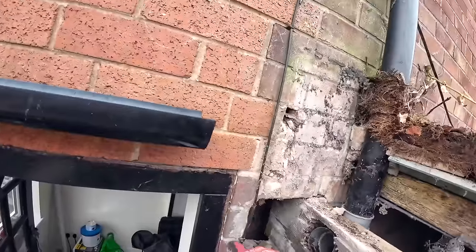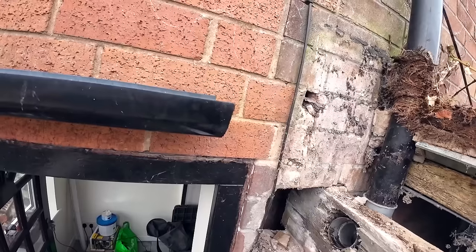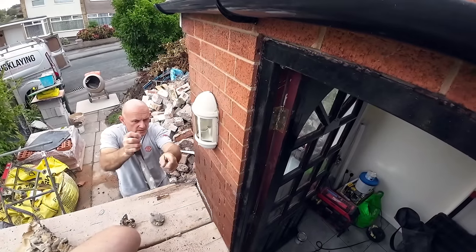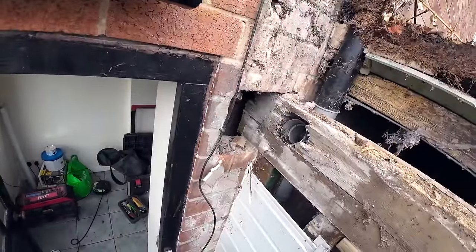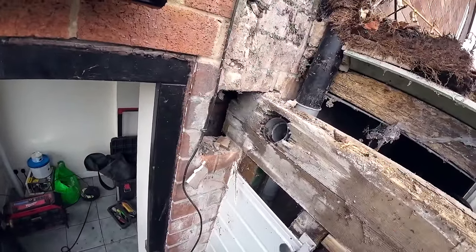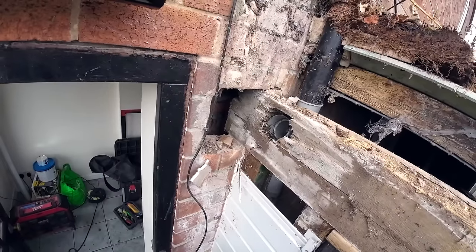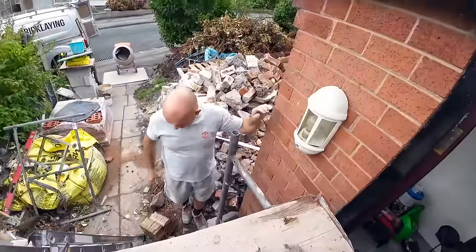So we're just going to do the same for our steel? No, we've got to come hard, and the holes need bricking up. Oh, yeah, but we're doing the same thing, aren't we? Yes, yeah, so we need to, that timber lintel. See your stud underneath it? Yeah. Comes to the other piece. You need to cut the timber lintel down there, so we can take it out, and we can brick that hole up, and form a new hole above it. Okay. Could you grab me the wood blade then, please?